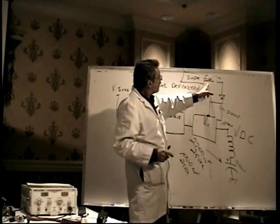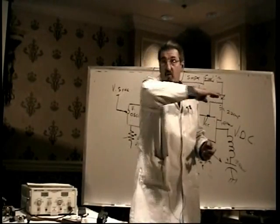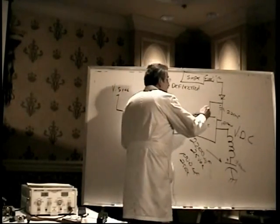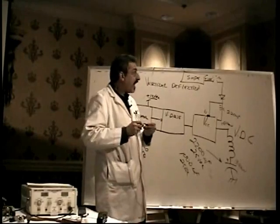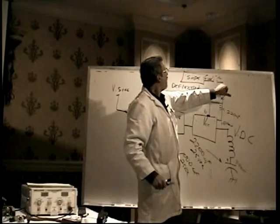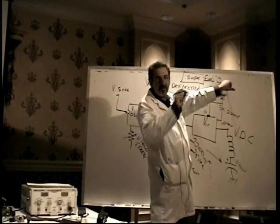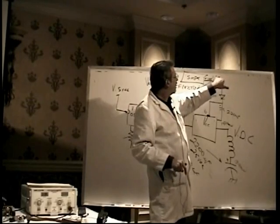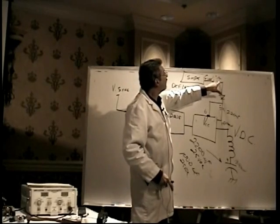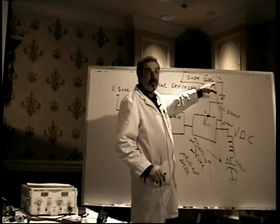Well, if that resistor is open, of course, that explains why I don't have any power to the chip. So you get to the monitor, you just have a horizontal line on the screen, you say to yourself, I have bad vertical deflection. You measure the voltage at pin 6, or whatever the pin happens to be, and you say, yippee, it's not there. Cool, that explains it. You can either, at this point, look at the schematic and go back to the power supply, or even just look at the power supply itself and measure the diodes and the low ohm resistors, and say to yourself, either with the power on, gee, I don't have any voltage on that side of the resistor, but I do have my 26 volts on that side, so I assume the resistor is open.